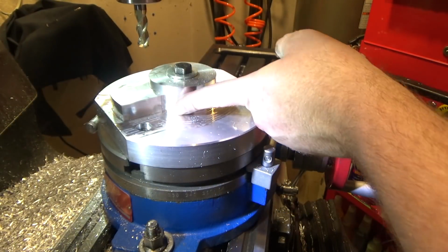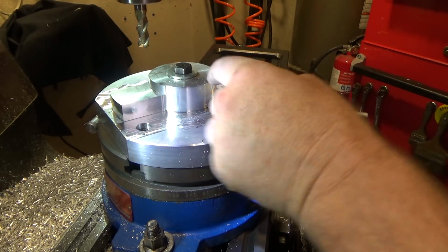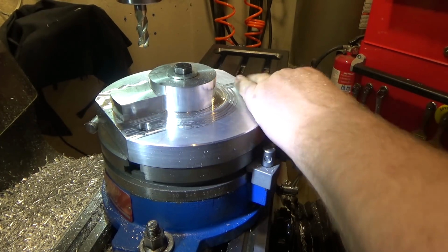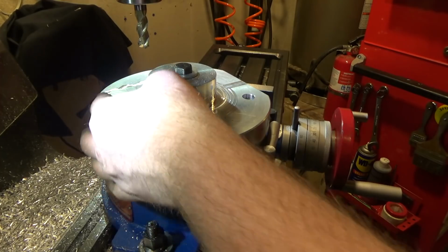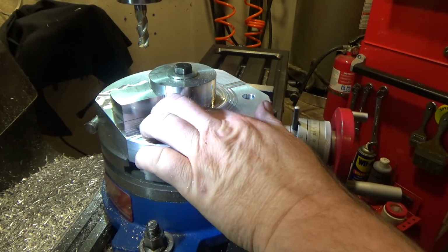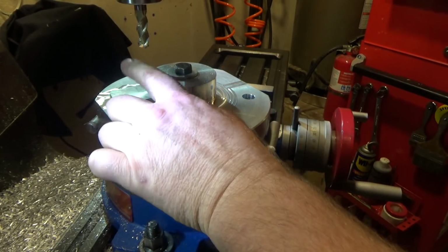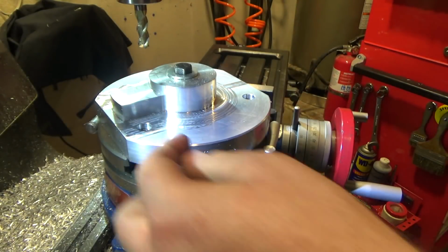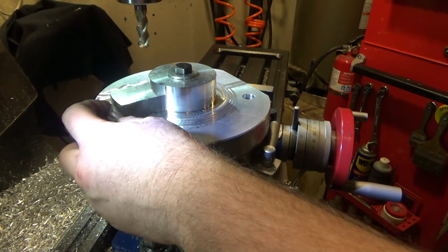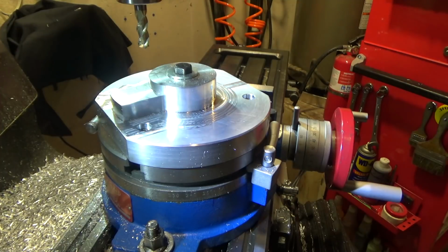So then I went into my final radius and did a once around from 325 to 35, which is 1/2 degree off, but that cleaned up this whole inside part, got my radius in the right spot. Now we can just bore the hole and we should be nearly done with this part. I'm going to have to still drill and tap on several spots for the set screws that are going to hold it in place, but we'll be mostly done.